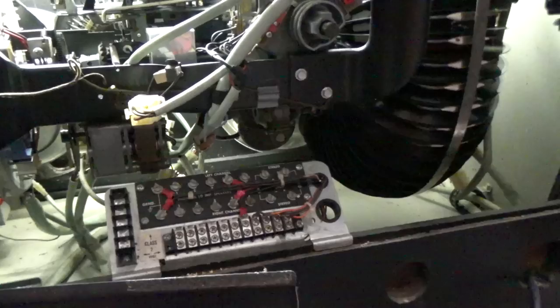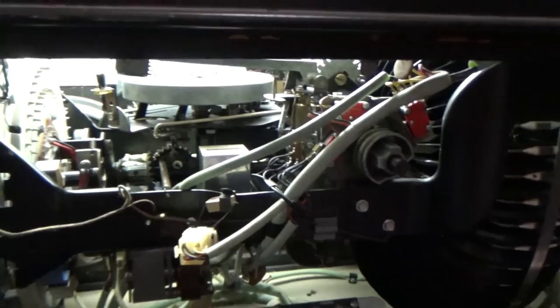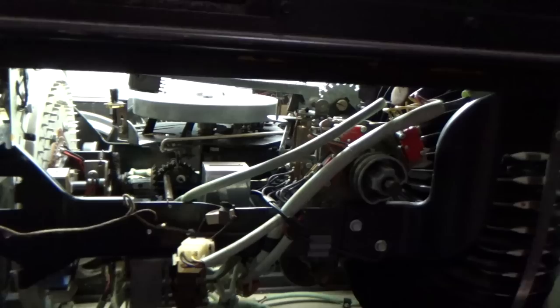Okay. So this is a pretty good one here. This thing's in pretty decent shape. Now the cabinet is kind of all particle board, right? So if they get really wet, you'll start having things like the wheels coming up through the bottom of the cabinet, and you just run into problems. However, all of the stuff that matters is metal. So the entire movement, like the entire mechanism, just about everything on it's metal. So with a few exceptions, even if the thing gets flooded, if you get that thing clean again, you should be able to get it running again. The cabinet might be falling apart. But you can see that they've stiffened it up with big brackets and things, because you can imagine that this thing's fairly heavy. Just the records alone is fairly heavy.